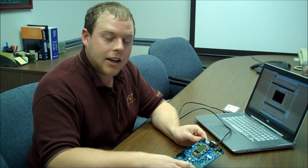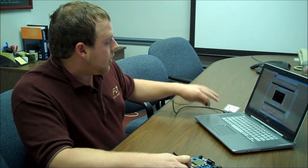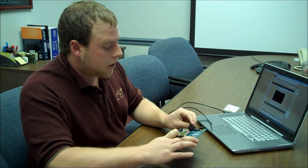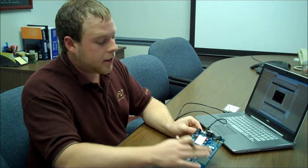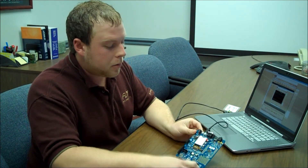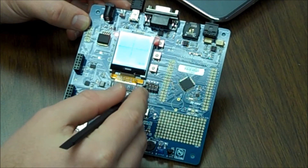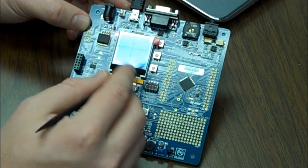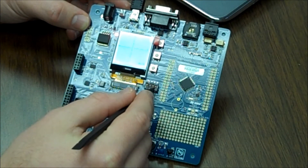I've just set up all the tools from the installation DVD, and I'm going to power up the board for the first time. I've connected the USB cable that came in the kit to the RL78, and I'll just plug it in the debug port at the top of the board, and it'll boot with one of the sample demos from the DVD. Now the board is in run mode, and we know this because Switch 5, positioned to the bottom right of the LCD, the four switches are all positioned up.